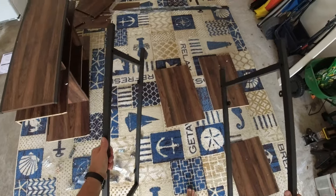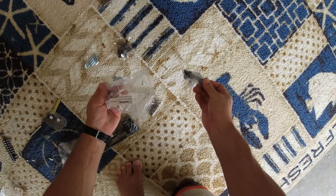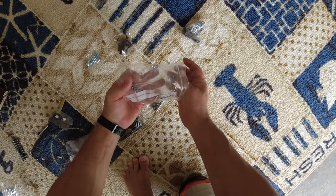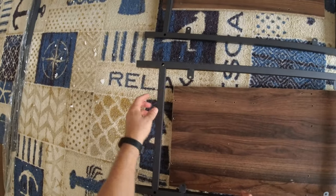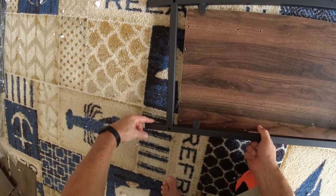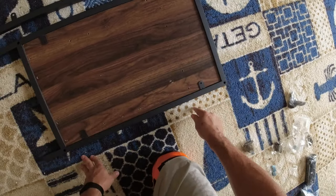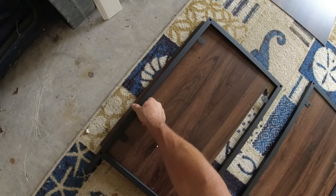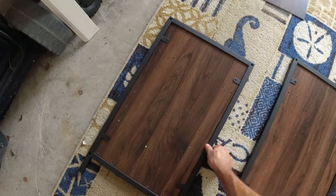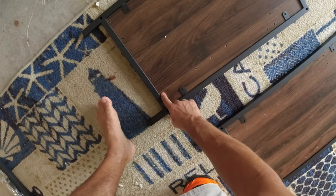And then bring the metal frames over, because you're going to be fastening those with the E screws, the screws from the E bag. These are those wood screws. Now these metal frames go exactly like this, and they're going to be flush with 4 and 5. Exactly like I'm showing again. You could put this the other way and they won't be flush and it won't look right.